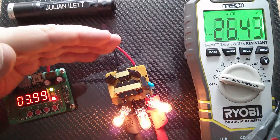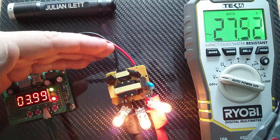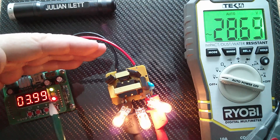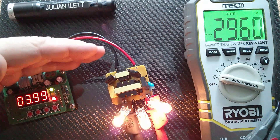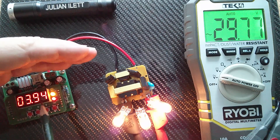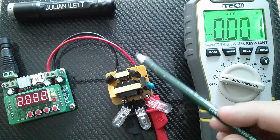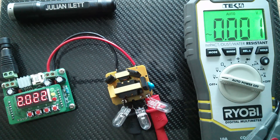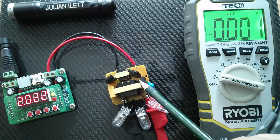It certainly works but the transistors do get very hot, and that's causing the circuit conditions to change because the semiconductors are getting hot — that's just changing everything. I don't think this is going to be a major problem because the input voltage is dropping off in order that the current doesn't go over 2 amps. The idea of this is to remove power from one cell in a series pack and transfer it through the bridge rectifier across the entire pack, and that's only going to be done in bursts. So the idea that it gets hot with continuous use I don't think is a major issue.